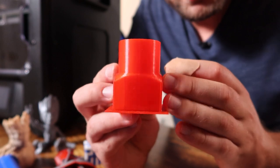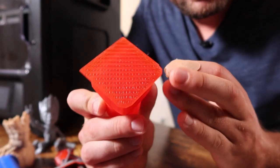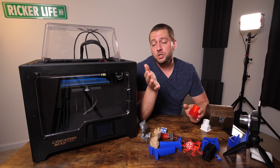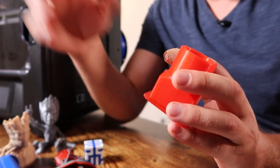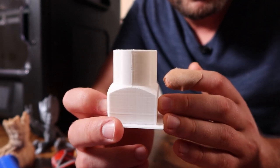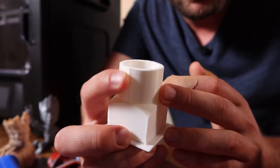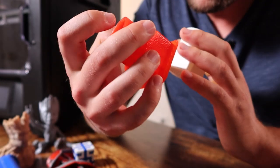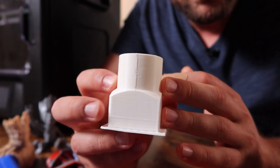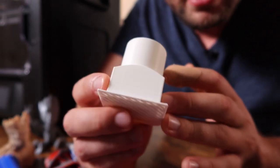Here's a design from the SD card, printed in PLA with the right extruder. I kept the raft as part of the preloaded design, assuming those are the best settings for this printer. The PLA version from the included spool came out nicely. The ABS version doesn't look quite as good — there are some lines that weren't there, which could be due to old, somewhat humid filament I had from last year. It really looks like a defect compared to the cleaner PLA print.